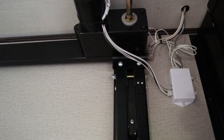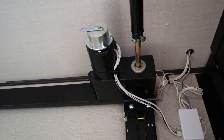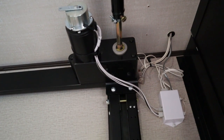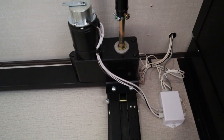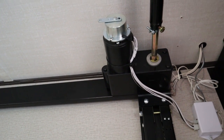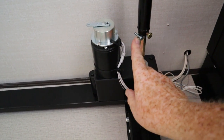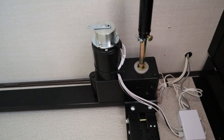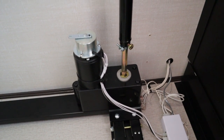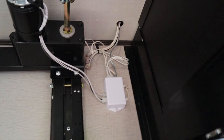On the other side, the shaft just slides onto that hex shaft over there. What's been happening is the set screw would loosen up, allowing this shaft to slide towards the motor and gear case. Eventually the driveshaft would come off the hex on the other side entirely, causing the bed to fall. Obviously that's a bad deal. This should absolutely prevent that. It's a fuel injection hose clamp — a regular worm-drive clamp would be fine too.